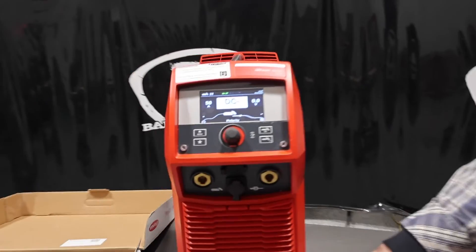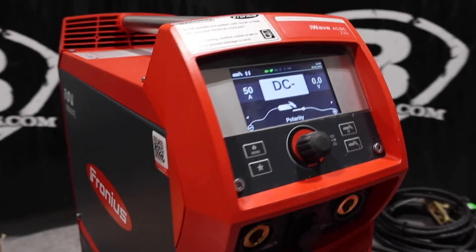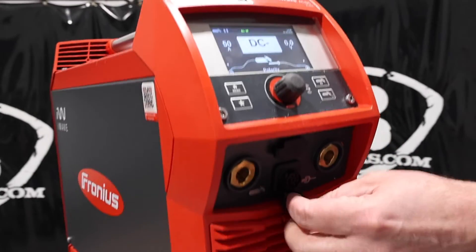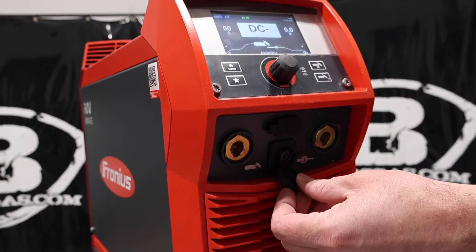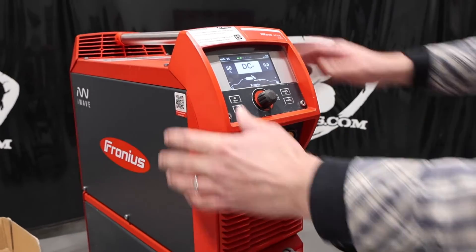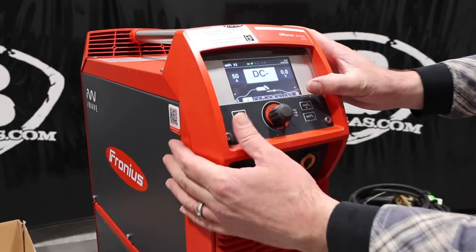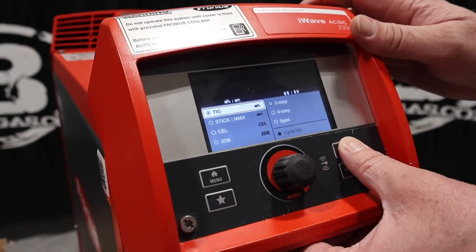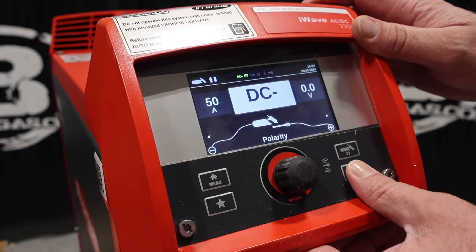Water goes in the very front and it comes with coolant. We got our two coolant ports here, our remote cable for the TIG torch or foot pedal — we can do foot pedal on that — two DIN inlets, and our menu button, our memory button there. This is going to call out what we're doing as far as that goes, and then that's our purge button.